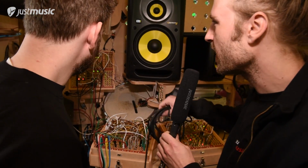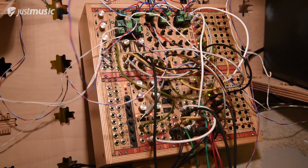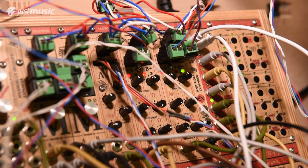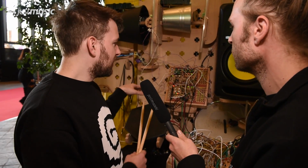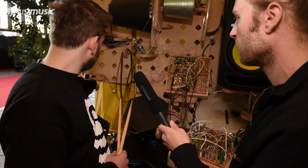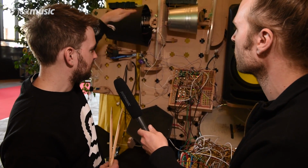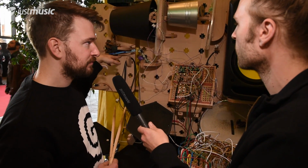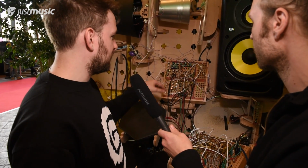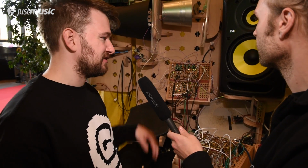Tell us a little bit more about the setup. You also had trigger motors. Yes. So this time small percussion set. How it comes? So basically we have 3 modules that interface modular synth with the physical world, and 3 output modules for motors. One for solenoid motors, that's these things that move back and forth. Then we have 4 DC motors, they're DC motors. And then this is a servo motor. So yeah, so 3 different types of motors, each one is good for something else. And now it's being sequenced from the Nitrider sequencer. So yeah, I guess that's about the mechanical part.